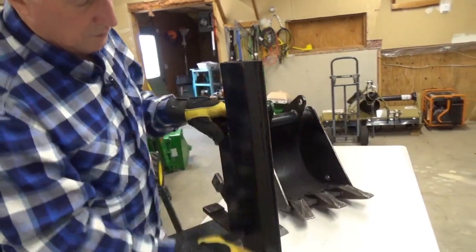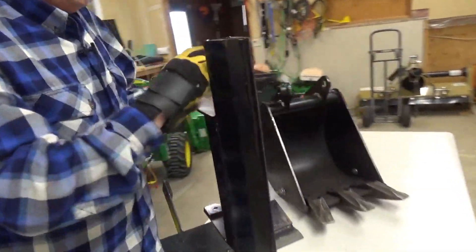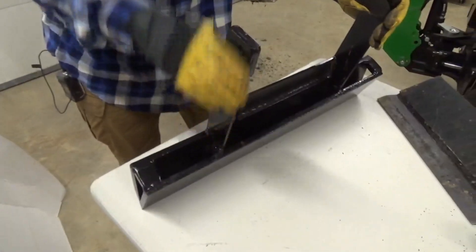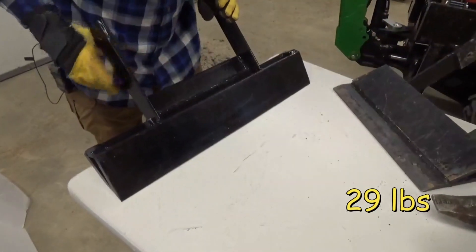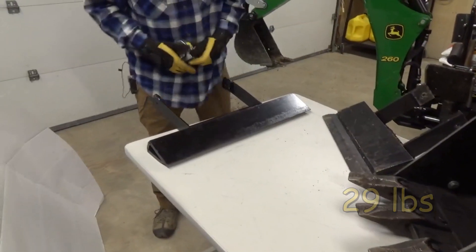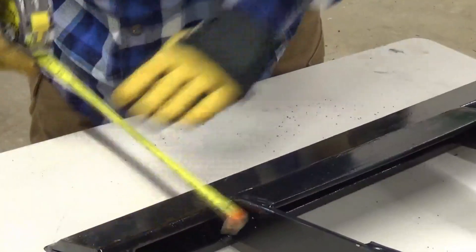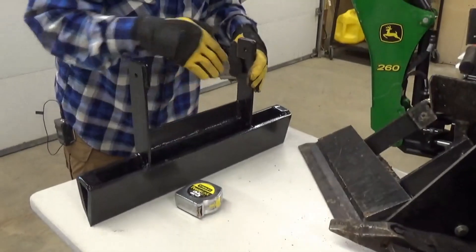So let's take a closer look at the new blade that we built. I used a snow plow blade again because I had a couple of those laying around. You can see the beveled edge here and here — basically I just make a wedge like this. I shouldn't say I, Kenny does — Kenny's an excellent welder as you can see. He put some tabs in here for strength, a couple of ears here to attach to the bucket, and a brace in the back. Then he ran a weld along here and really that's it. I weighed this and I'll post that. I had a little bit of a concern about how much weight I could add to the bucket and not cause problems. Measurements: four inches on the face, back sides about four and a half, and 24 inches wide. There's enough gap to get between the bucket so the teeth fit in here.